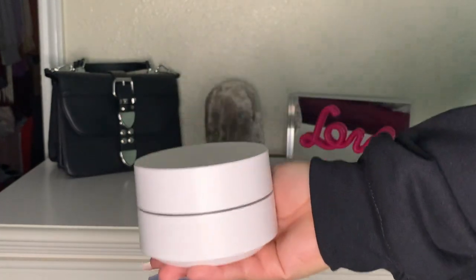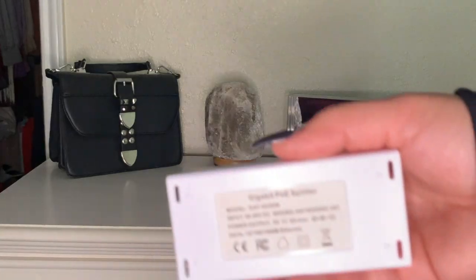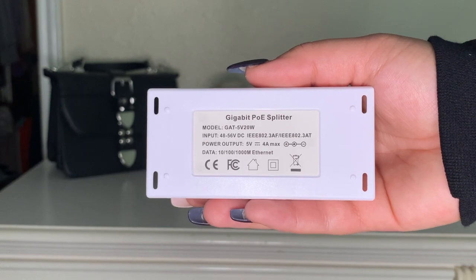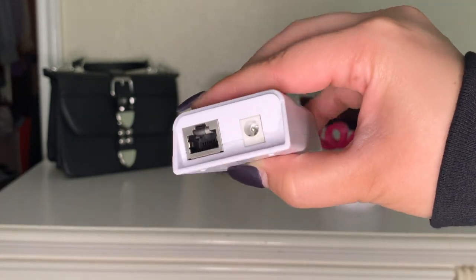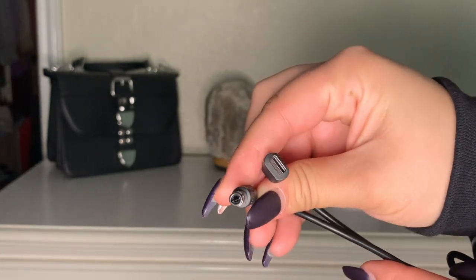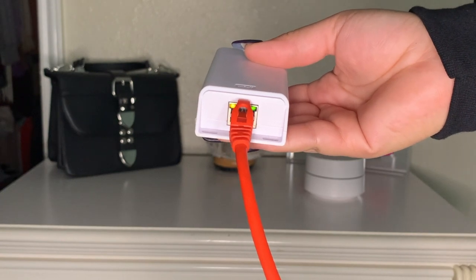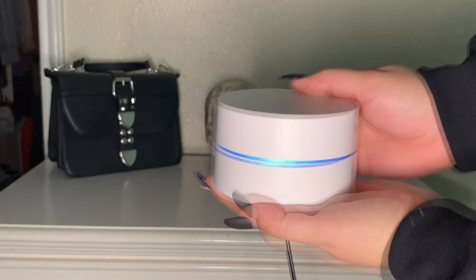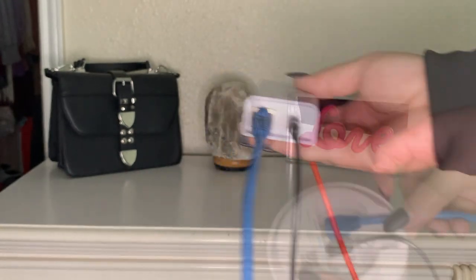The last device I'm going to power is a Google Wi-Fi puck. I personally don't need an additional Wi-Fi router in my apartment, but this is a commonly used device, so I wanted to show it can be powered using PoE. This device takes 5 volts 9 watts over USB-C and has a LAN port for input data. I'll power it using our GAT USB-C legacy splitter — the GAT 5-volt 20-watt — with a 2.1 to USB-C cable. The splitter is capable of 20 watts output, powered by 802.3 AT PoE, and passes through gigabit data on the separate female RJ45 connector. The blue LED across the router lets you know it's receiving power, and since I'm bringing in wired data, I'll use the data output port on the splitter, then connect the other end of my category cable into the LAN port of the Wi-Fi router.